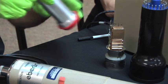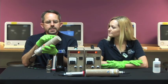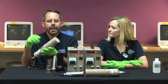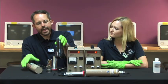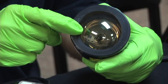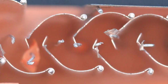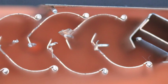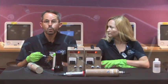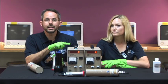The second one is a scintillator attached to a photomultiplier tube. The scintillator is a crystal of sodium iodide, and when ionizing radiation passes through it, it gives off a little flash of light. That light then strikes the front of the photomultiplier tube and knocks an electron off the surface of the coating. That electron is then accelerated through a series of little paddles called dynodes. When an electron strikes a dynode, more than one electron pops off. So by the time you reach the end of the dynode chain, you again have an avalanche of electrons that can be detected and counted with the scalar.